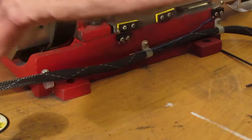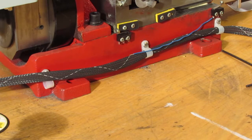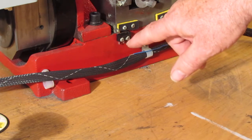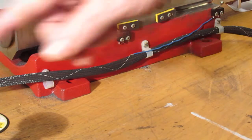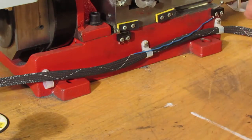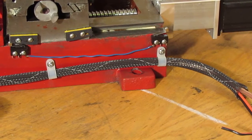It's not necessary to run a separate ground wire for the other set of switches. The DC return ground signal can be picked off one of these switches here and just wired to the two switches on the front - there's no point in running another wire through the sheathing just for that. So we're going to have an X and a Y signal going back into the box, and just one ground that will be used for both sets of switches.